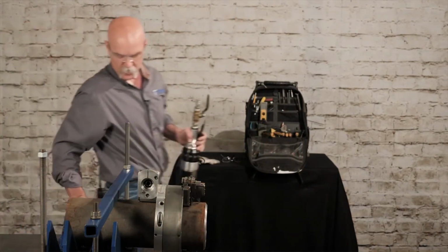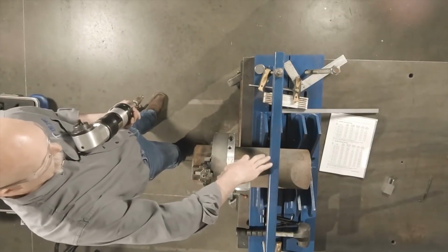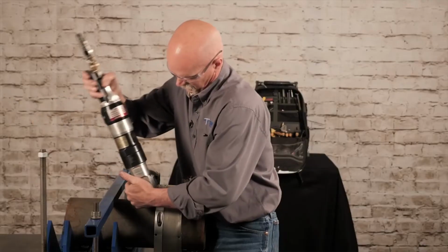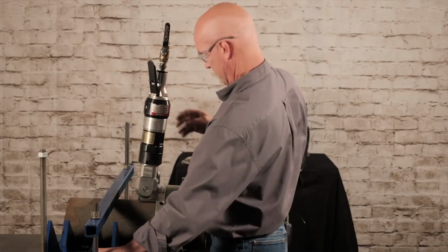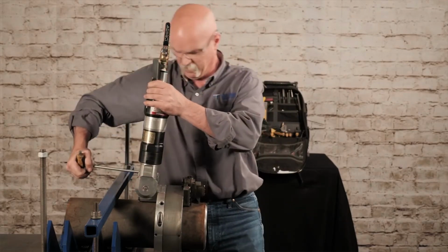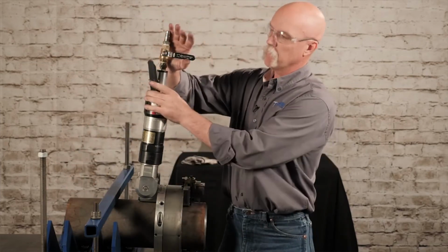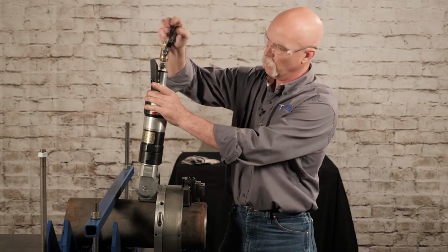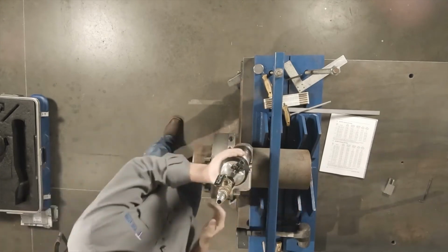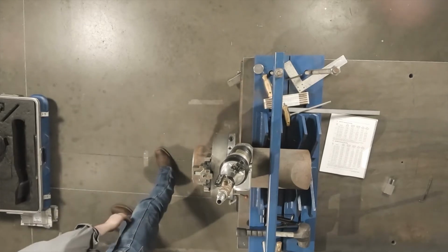We're going to use the heavy duty air motor. You'll notice it has multiple holes in the torque restraint bracket, so you can choose different locations if needed. Has a ball valve that you can use for throttle control, but you'll notice it also has a dead man switch for safety. These motors need to be ran with an air caddy, and so we have our air caddy and water separator.